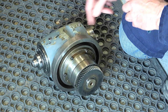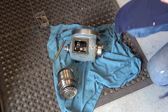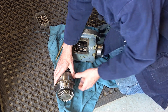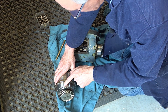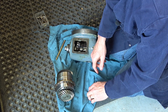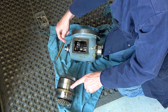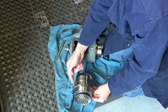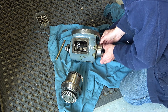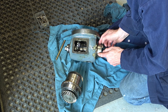It's either in here or it's in here. I've got the transfer shaft out and this feels fine to me — it turns very easily. When you put it back on you have to be careful because there are three holes for the drain holes for the oil, which need to go at the bottom. This is held on by six cap head Allen screws, and you can use a couple of screws from the top cap as extractors. It still feels very sluggish — but I'm thinking probably it's grease drag. The grease in this bottom bearing is quite old.